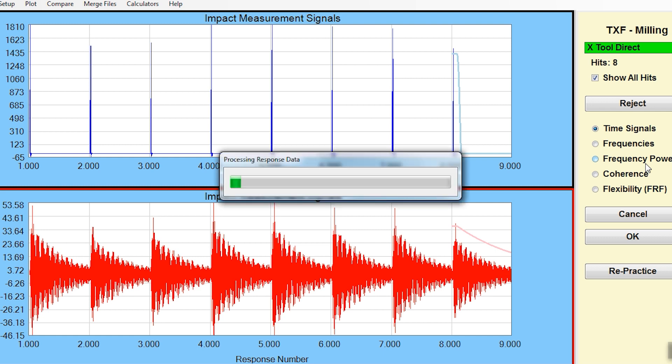In the plot, we see a comparison between aluminum — the dark green — and epoxy — the light green. What is immediately observable is that the epoxy tombstone's vibration decayed much more quickly than the aluminum tombstone's. The light green returned to zero much more quickly than the dark green, which is the aluminum. That indicates the epoxy has much higher damping than the aluminum material.